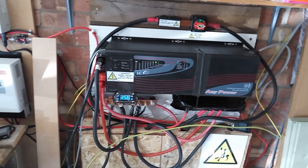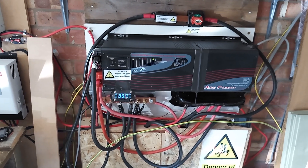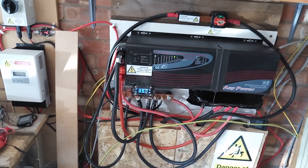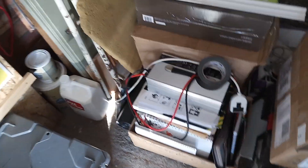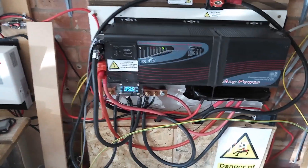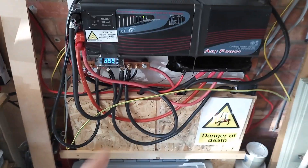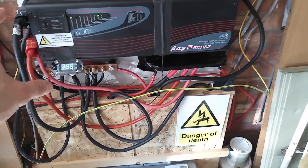Maybe 19 volts — I haven't decided yet, a bit more research to do. But that will give me enough headroom so I'm not only using 50% of the battery; I'll be using the 20 to 80% range. I've got this charger which I'm going to connect up when I put the Victron relay in — it's indoors at the moment. I bought a BMV 712 Victron, so I'm going to put the shunt in the middle there and get it all boxed in.